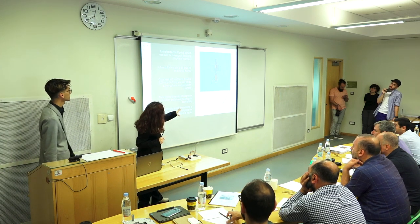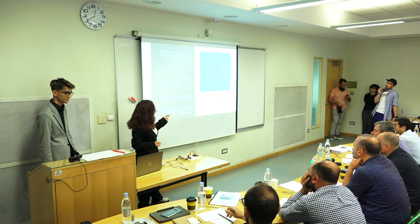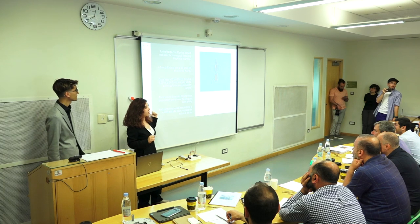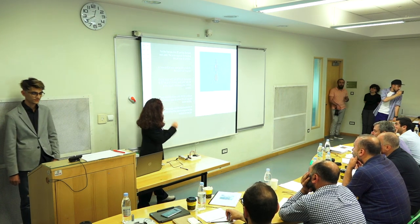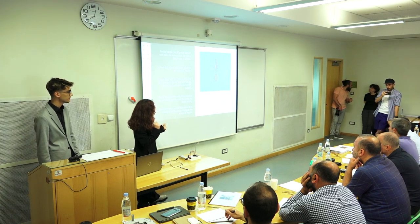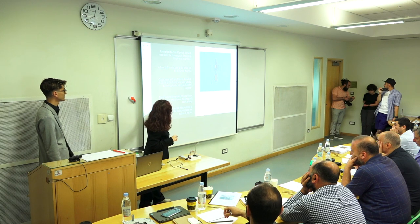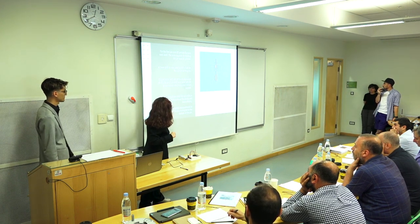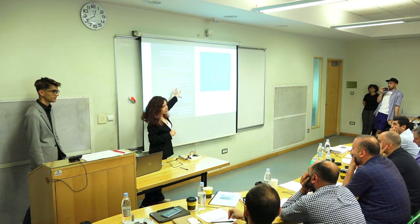We used a 3D printer filament as our core. We drilled a 1 millimeter hole in it to put the magnet inside, as was seen in the diagram. And this was our printed core. And we wired the coil by hand, very badly, very non-uniform. We supplied 5 volts of power. It consumed 500 milliamperes of current, and we used 0.09 millimeter wires and 0.5 millimeter wires.